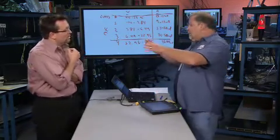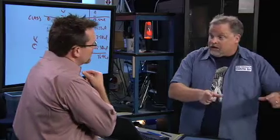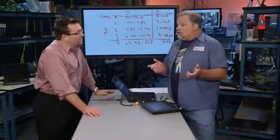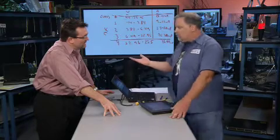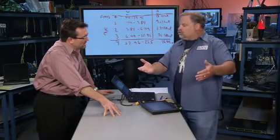So I've got a phone, and now I've got a feature called AT Detect. On AT Detect, I can tell that this is an AT device and send it power, and I can say this device at idle only needs six watts, but at full start time it's going to need more. Like a night vision camera — the status of the device itself is going to change over time. Why be sloppy about what we're sending it? If I've got a PTZ camera sitting there not really moving, in idle until it detects motion, then once it needs all that power, I can instantaneously switch and bring that power up. It's very cool.